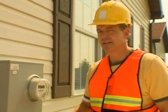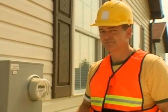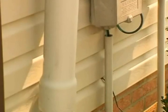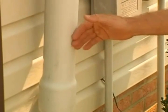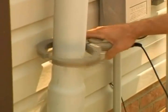When locating secondary cables, the meter box is the most convenient place to access the neutral. Sometimes the riser pipe is non-metallic, usually PVC. If this is the case, you can put the clamp right around the riser.